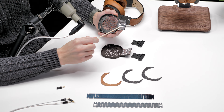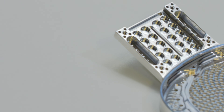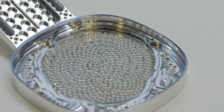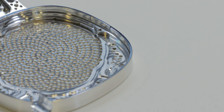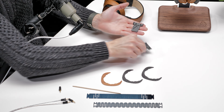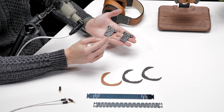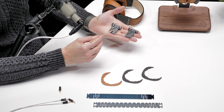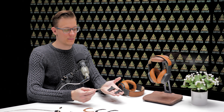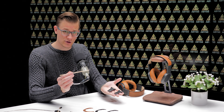Some of these magnet pocket holes actually go into this logo a little bit further, so they're non-uniform depth, to maximize the material removal and ensure we have closer to even wall thickness throughout this structure here. This slider portion of the frame is actually machined out of a different grade of aluminum — this is made out of 7075 T6 aluminum. We need that for the additional stiffness and strength to achieve this design at low weight. We managed to shave around 0.4 grams per side off with the new design. We're just making these now so it'll be a little while before they roll out, but we added some drill holes, changed the pattern a little bit, and changed the wall thicknesses and geometries a smidgen.